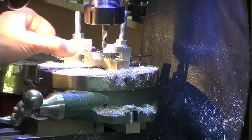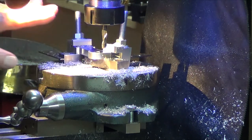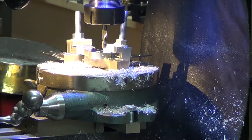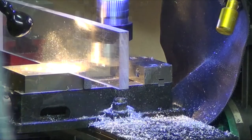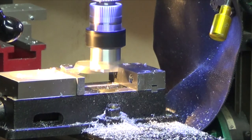Also forgot I gotta clamp this thing because I had to do the bevel first, because after I do the two rounds, there's no way I can clamp this to get a 10 degree bevel or bevel chamfer on it. So I gotta tear it all down and start all over. This will remove the shield so you can see it. It's mounted in there at 10 degrees.